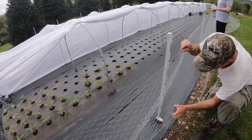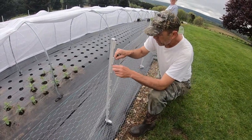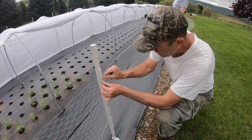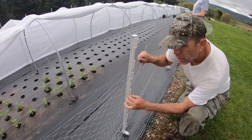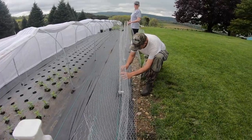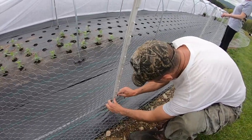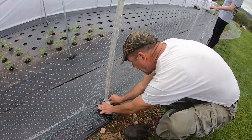It's a little unwieldy at first when you're getting started, but once you get a couple in, it goes pretty good. We're picking the second notch down and catching the first line on the wire, then working our way down. You want to keep it tight at the top because if you don't, you're going to get a sag. Over time, the wire is going to get a little rusty, and you don't want people scratching themselves and having to go get a tetanus shot. Remember: underneath, latching under that point.